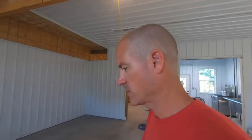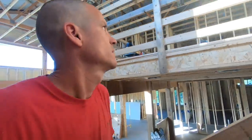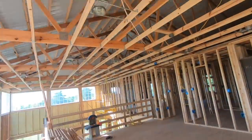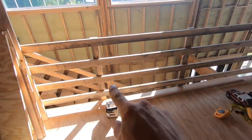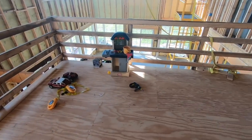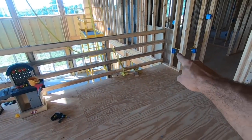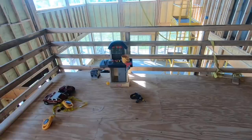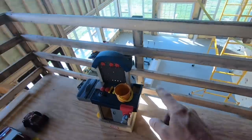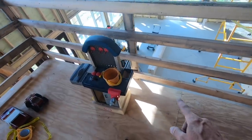And then in the house, he wanted two outlets added upstairs along this railing, and I'll show you that. I really didn't want to put them along here, but it's required. So I have to have an outlet along here and an outlet along here. Because according to the NEC, railing is considered wall.